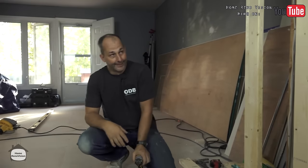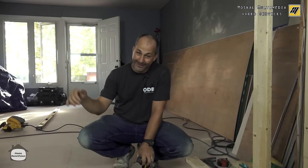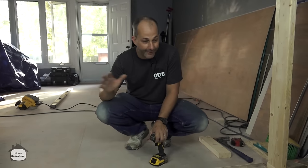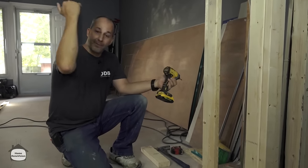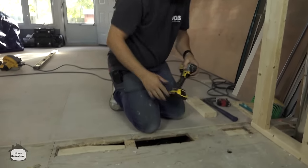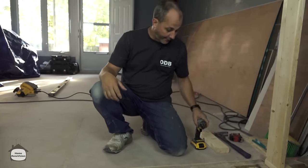We're working in our kitchen project and I've got a big issue - we had a structural wall that was right in the way of where we want to put our island. We were a little disappointed; we figured there'd be some mechanical and stuff but it turned out to be structure. In that wall we had cold air return, two different heat runs, plumbing lines, water supply, venting. So we removed all of that, built a box, tucked everything into one corner, dropped the ceiling and rerouted everything upstairs again - but now we have this issue we've got to deal with.